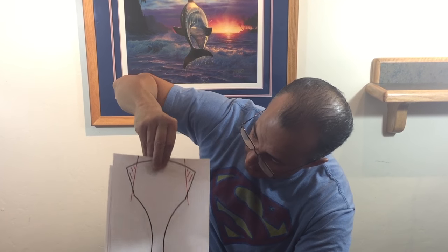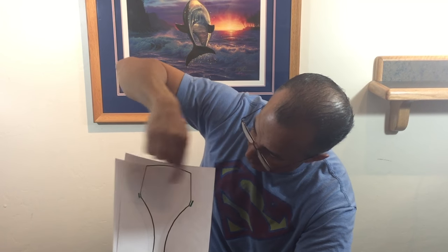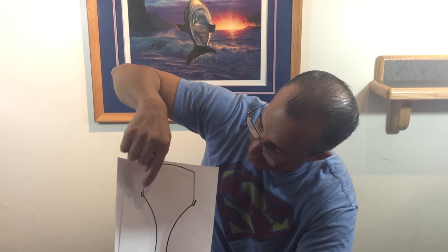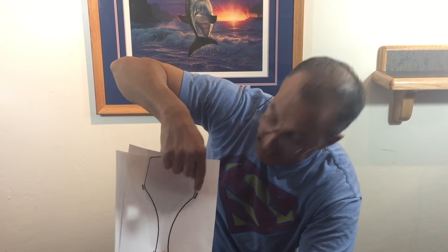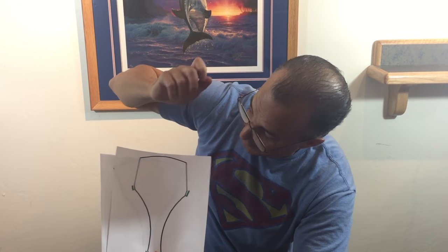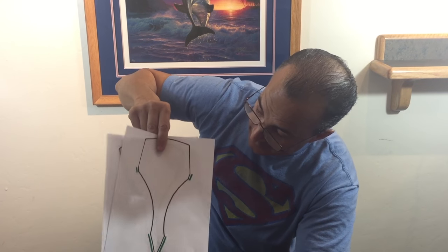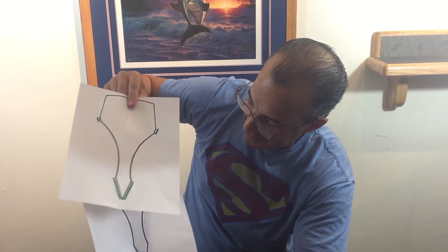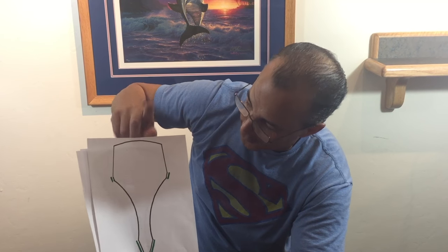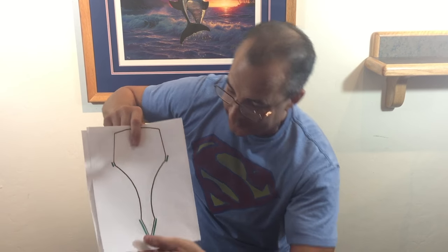What you want is to leave just a tiny little part — marked in green on the drawing — in contact with the stone. So instead of those big wide wear bars, you only have this small part in contact, and that seems to clean up the edge. Can't fully explain it, but it works out really well. It's definitely a cost-effective alternative to re-grinding.